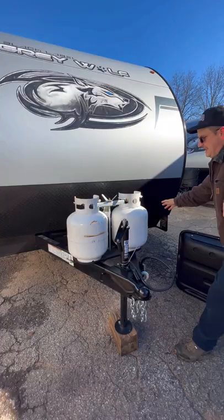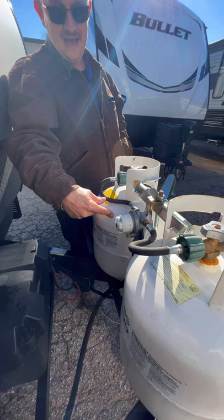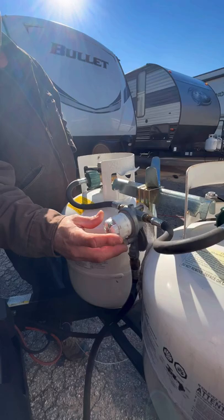Right here you're going to have two 20-pound cylinders that will be full upon arrival. If you look right behind here, there's a little dial. Right here, it's pointing to this tank right here. You can pull from one tank at a time, or you can pull from both — which is going straight down right here. If you pull from both, you're going to run out at the same time. So I prefer you pull from one, you run out, then you can switch over to your other tank with this pointer right here.